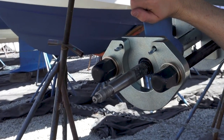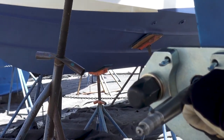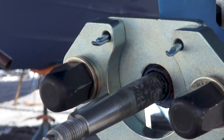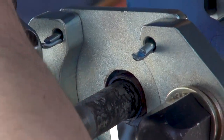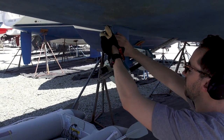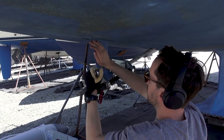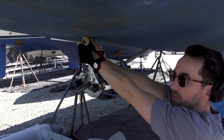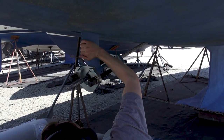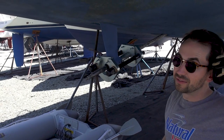It's probably about three quarters of an inch out, so we're just going to keep cranking it. You get a big wrench and essentially you're just tightening each one equally and pushing it through. We were also using some anti-seize lubricant, but the instructions also said to use dish soap. I'm assuming as the cutlass bearing starts coming out more and more it's going to get easier because there's less friction. I'm going to put my headphones on in case it pops.